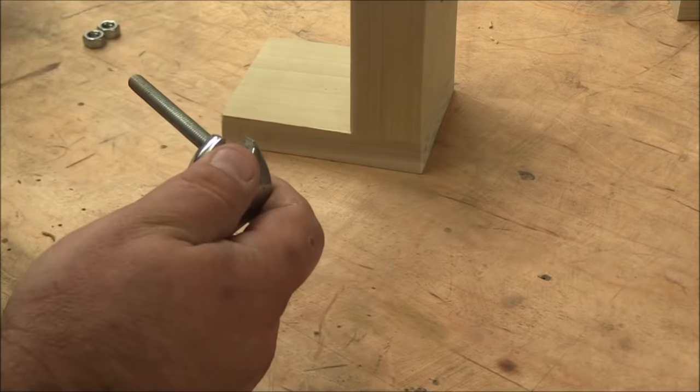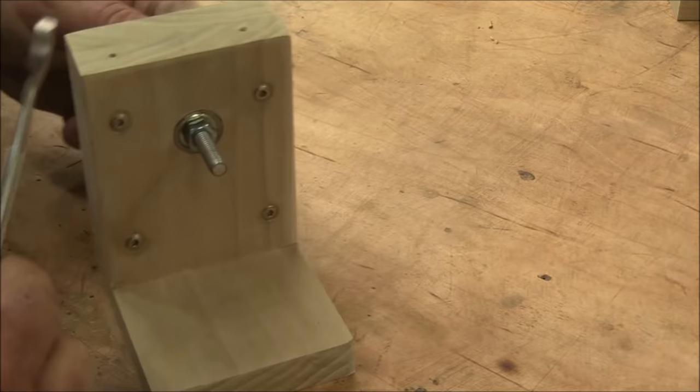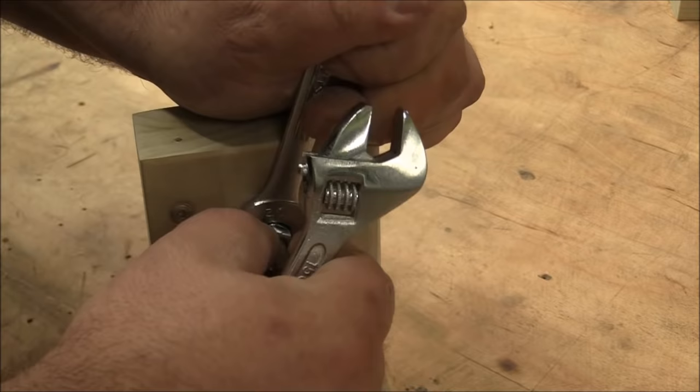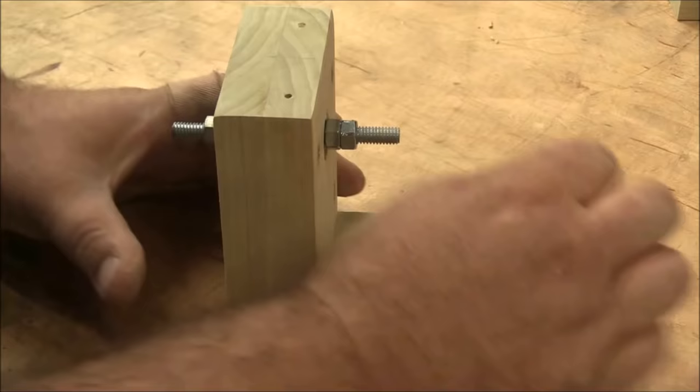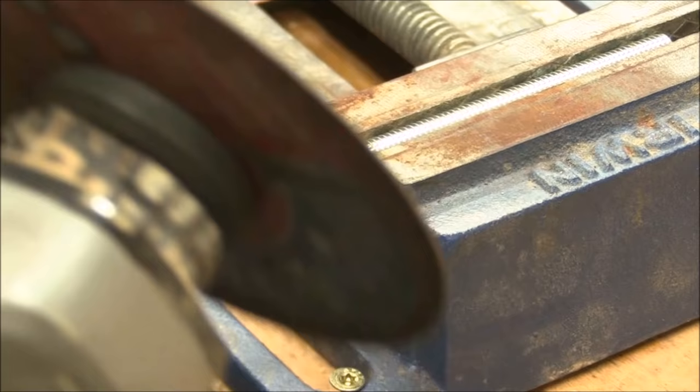After the towers are done I'm just going to add the bearings in, then use two nuts on a five-sixteenths bolt and leave about five-eighths of an inch proud of the two bolts, jam-nut them together, thread that through the bearings, and add a third nut to the opposite side and tighten it down until I feel some resistance. When I try and turn it there should be some resistance and no play in the bolt, then I'm going to add the last nut and jam-nut those two together, which will keep that bolt nice and secure in between the two bearings.